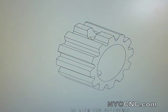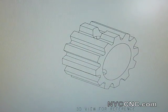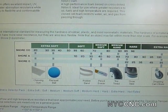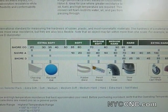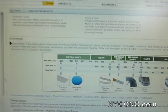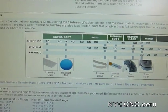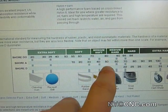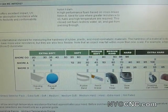It's made out of a urethane, and it needs to be somewhere around 40 or 50 durometer. If you're not familiar with the durometer scale — mine needs to be 40 to 50 on the Shore A scale — just go to McMaster Carr. Their website is really a great source of information, and if you type in rubber, you'll scroll down to a section on durometer and see that Shore A 40 to 50 is medium soft, about like a pencil eraser. So that's what we're going for.